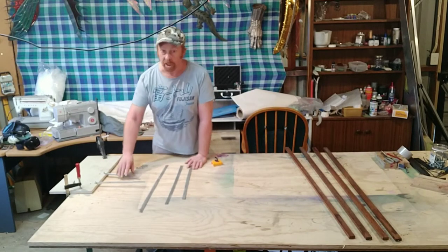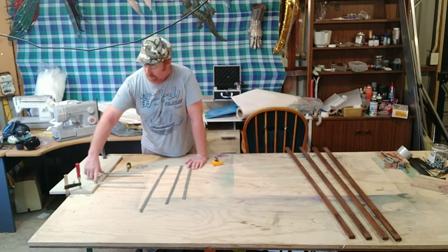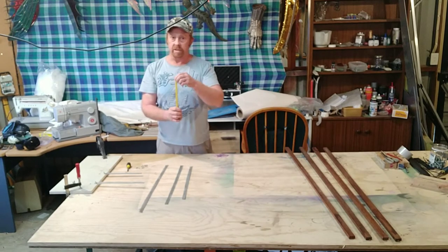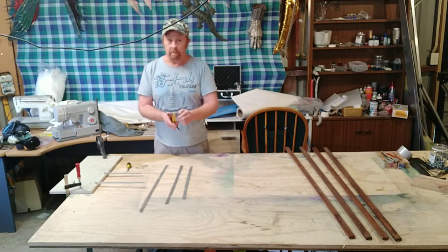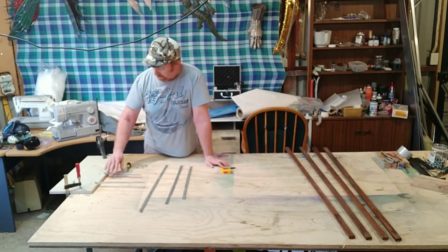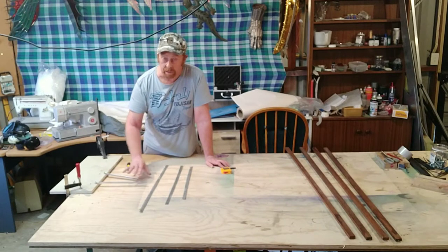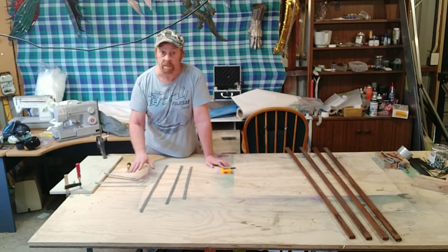I've just pulled this jig apart. I don't change these two here very much — I won't change the length. Our back brace has a 150mm gap here. The reason being, 150mm or 6 inches, is when I get a tape measure and get someone to turn around, that seems to be the average best size that fits along your scapular area, which is where your arm slash wing would come from. I'll change the length of the two humerus — what we call the humerus bones here. Obviously a bird only has one humerus, but we need to make it articulating. The easiest way is using this pantograph assembly, and then we'll work out the lengths of the radius, ulna, and digit from there.